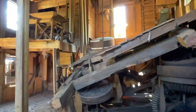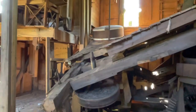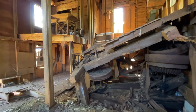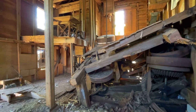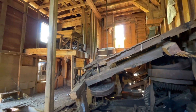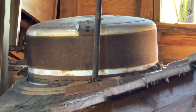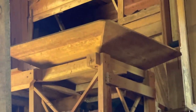Now the way this mill worked — the mill stones were on this spindle. These are what you call the country stones; it's a native granite stone that they used for corn. And there was a third run of mill stones in this building — three runs of stone total. The third set, which was about here, was not in use. There was no spindle, only the stones. And this set of stones is a French burr stone, which was used for the wheat.